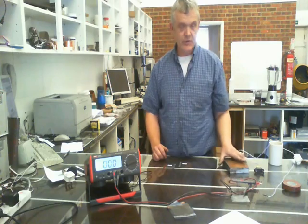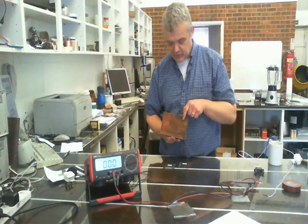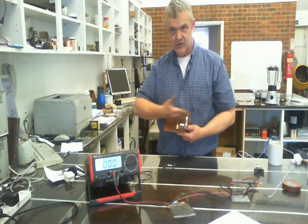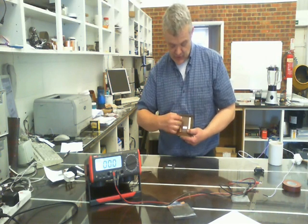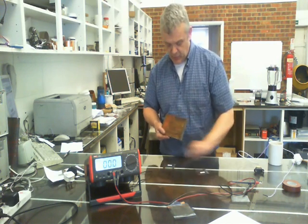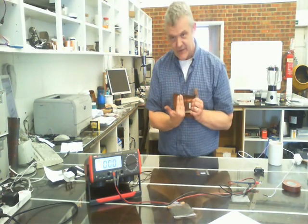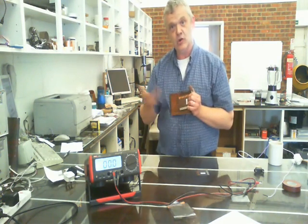Here's what we're talking about with the lines on the block — those lines represent the magnets, and the magnetic field is running north-south in that direction. The sample placed parallel to those lines had its graphene rotate in that direction because it's diamagnetic, meaning it now lies between the metal plates with poor conduction. The sample at 90 degrees to the field had the graphene rotate so it lies much more in line between the two plates, giving an improvement in conduction.